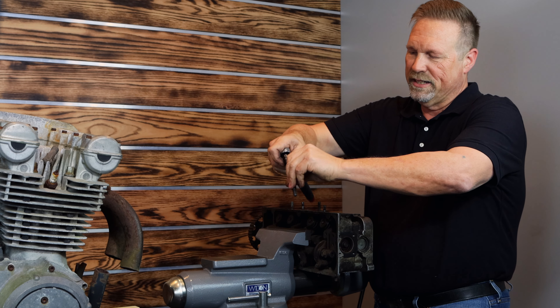One of the great things about this is you can put this back down in there. Let's say you're out in the field trying to repair a piece of equipment and you don't have a replacement bolt — you're going to have to reuse that old bolt and you don't want to down the equipment. So down goes the bolt, we bang our extractor socket back down on there, and I can tighten that down — I could shear that bolt off if I wanted to. It's locked in, it's not slipping off. Down goes the pusher rod and it will pull it right up off that fastener. You can go ahead and send that vehicle or piece of equipment down the road, maybe order a bolt and fix it later on. It's all about versatility and options — that's all your toolbox is, a big bunch of options. Extractor sockets can be your last line of defense: when nothing else is getting it out, you bang one of these down, it'll take it out and put it back in.